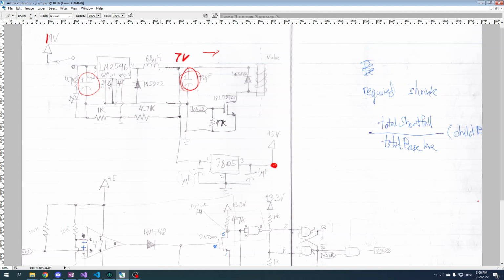I mean, I could give you just one extreme example. So let's say we have a load and it is drawing 1 amp. So that means that we would have 1 amp flowing through this inductor. Now, all of a sudden, there's a switch in the load, a transistor, and that transistor becomes closed. So now, let me think here. If there's 1 amp, that means that before you would have seen a resistance of about 7 ohms on that load, and that drops to 0 ohms. No, wait, wrong. That goes up to infinity ohms, or 100 megaohms or something. I don't know, whatever. A very big number.